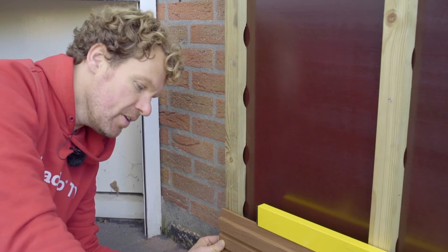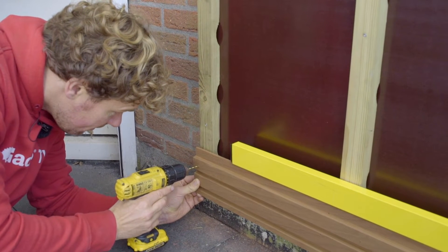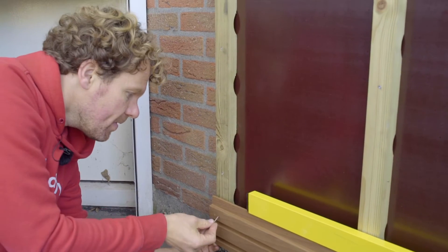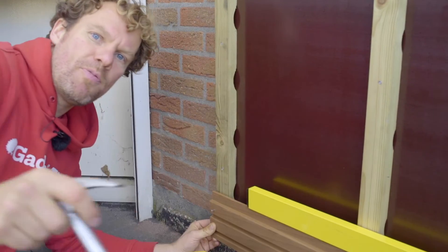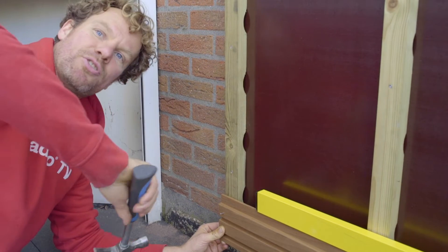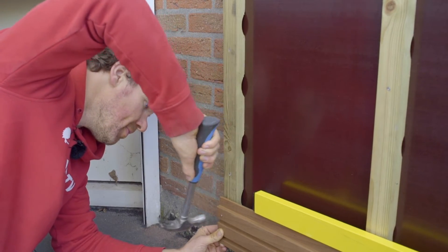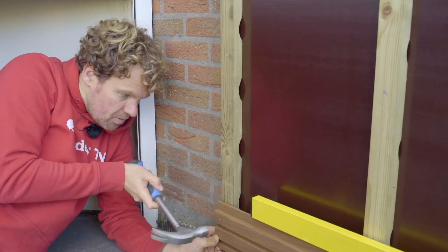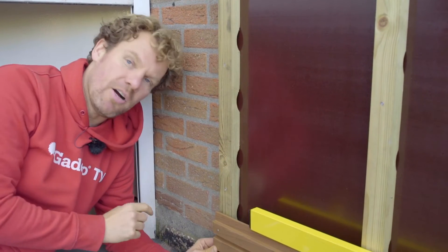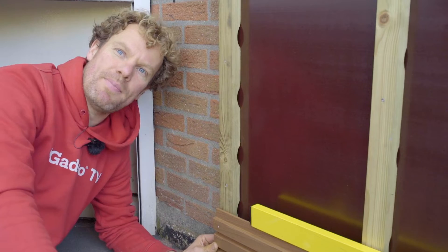Pre-drilling the boards at the center of the battens is recommended. Since this is a small project, we can use a hammer instead of a nail gun. However, a hammer doesn't work for the rebate between the bands since there's no room to strike. Instead, we're nailing the boards in through the bands. Make sure the head of the nail rests on top of the wood and isn't driven into it. Because we're nailing the boards in through the bands where they're thickest, we need 60 millimeter threaded nails.